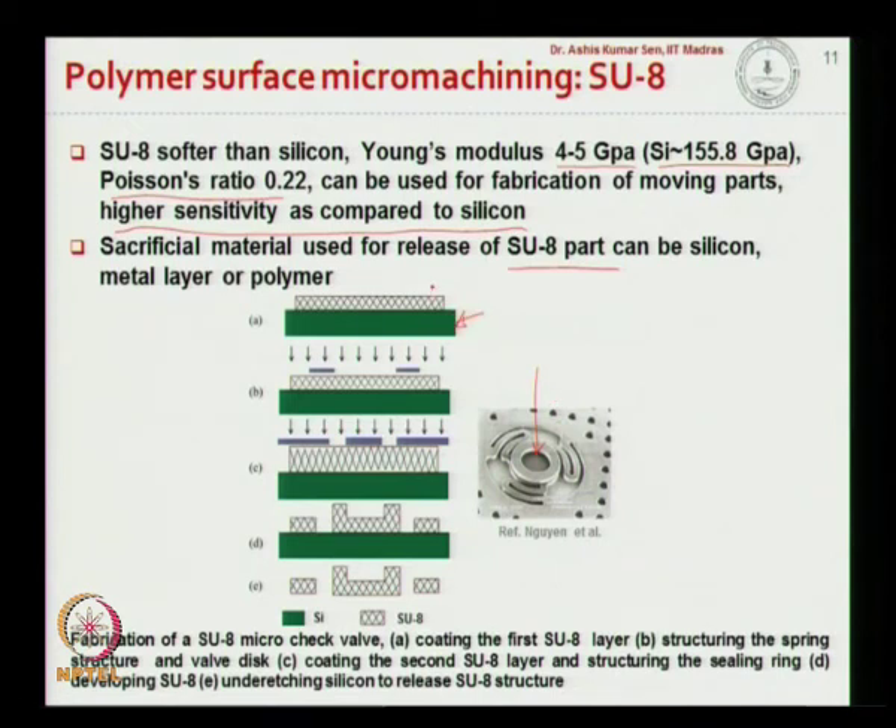This is a process to create a spring-like structure made of SU8. We start with a silicon wafer with a layer of SU8 on top. We do UV exposure through a mask, followed by development to get an SU8 pattern on the surface. Then we do selective etching and removal of SU8 in two specific areas. After removing SU8, we etch the silicon in a suitable etchant that does not attack SU8 but removes the silicon sacrificial layer. With the silicon underneath removed, this structure acts as a spring.